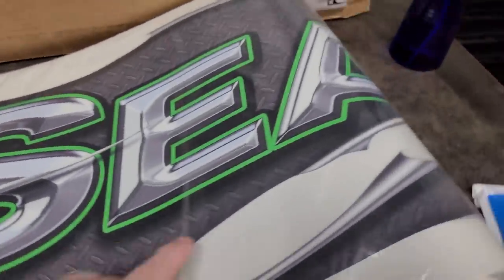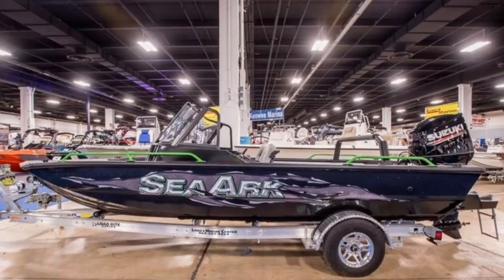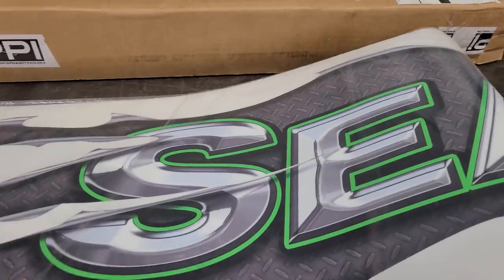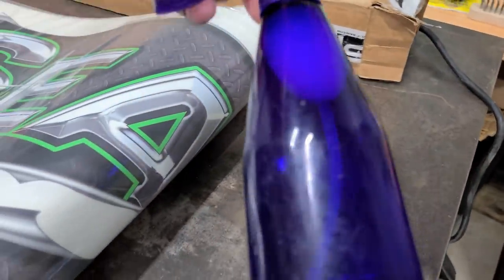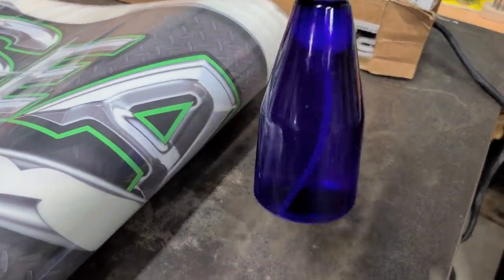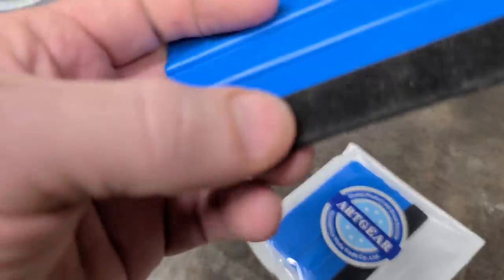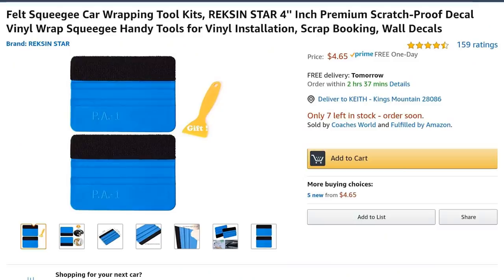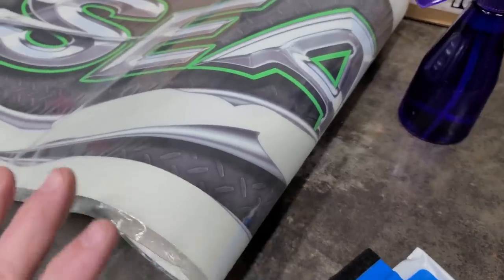This stuff doesn't come off easy. Now, the decal I'm putting on my boat is like 18 feet long — it's still rolled up, it's pretty big. It's the one that usually comes on the Procats. To put it on, all you need is water with about a teaspoon of dish soap in it, and these squeegees — one side's felt and one side's hard. I got them off Amazon; they're made for this type of thing. That's really all you're going to need, along with a clean surface.